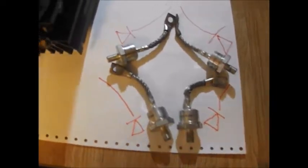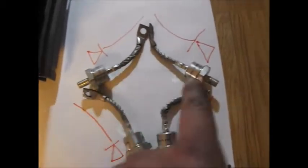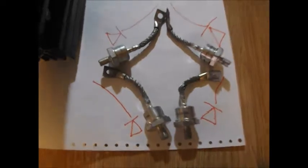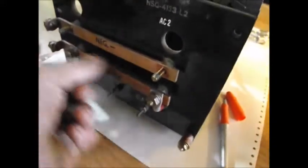So on this over here, you can see that for these two here, they're going into this one heat sink, because this is where your heat is going to be coming from — right here itself. It won't get any heat here. This is your DC — this one and this one. And here's your AC input. Here's your AC input — this one and this one. It doesn't matter black or common; it doesn't make a difference which way it goes. And then here's your DC. On this side you can see those two there, they go to a flat bar which is the bottom one, and that's the negative. And then the double here, which is the positive.